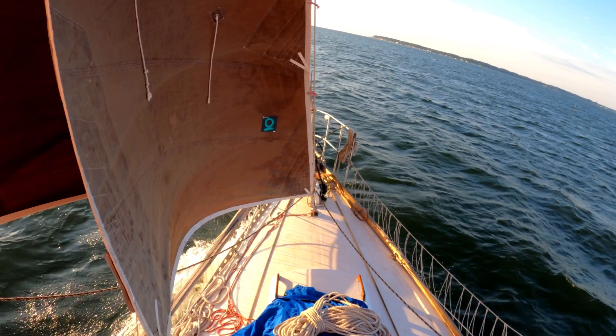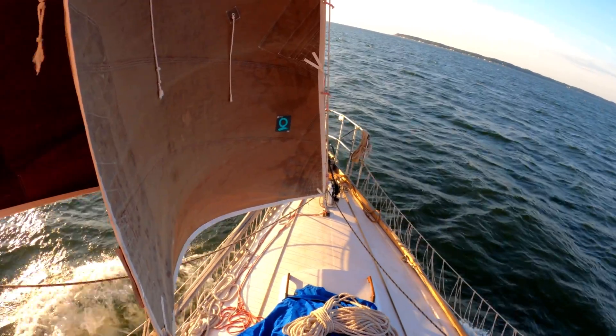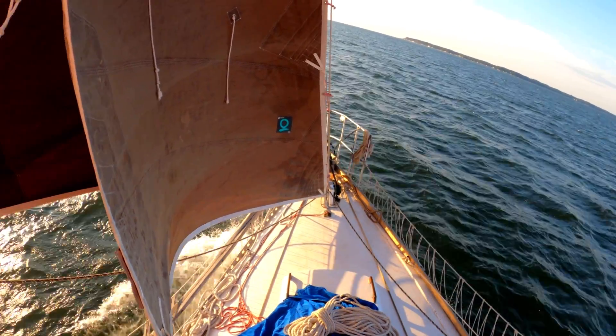If the chain plate wiggles or the bedding breaks down, you have a deck covered in water and it's going to go in through any holes. The chain plate is a hole — it'll make its way through, corrode the chain plate faster in an area you can't see and inspect, plus have water leaking into your boat. So none of that's fun.